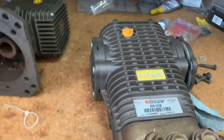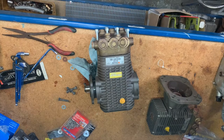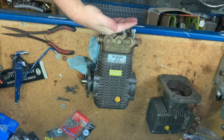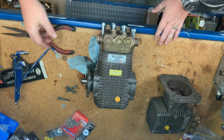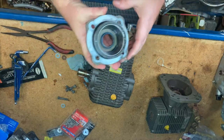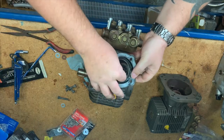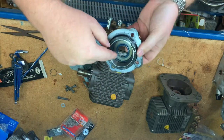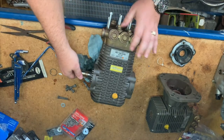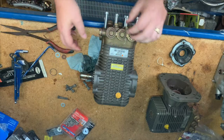I'll get the camera set up and show you what these pumps do and how they work. I'll break down the pump from the back to the front, or the head of the pump. On this side you can see I've taken this off — this is your bearing and your main seal. The blue thing you see in there is literally your seal; it does push out, there's an O-ring there. You've got a seal, you've got your race, and you've got your conical bearing. That bearing is very similar to the wheel bearing in your trailer.